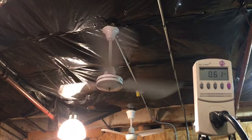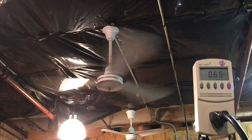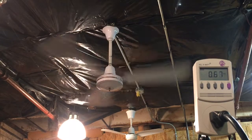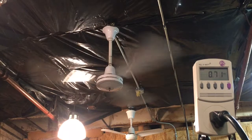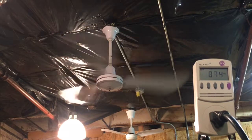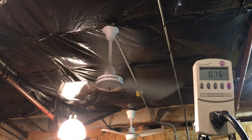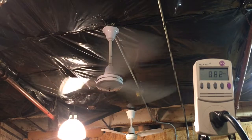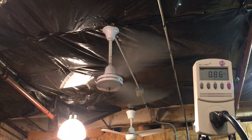Alright, so I'm just going to keep going. 23, 25, 28, here's 30, 34, 35. I'm just going to max it out at 40 microfarads. I'm still under, because if I hit high, I'm still well under with maxed out 40 microfarads.